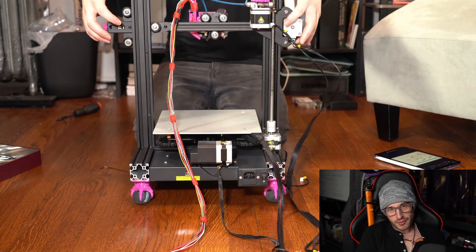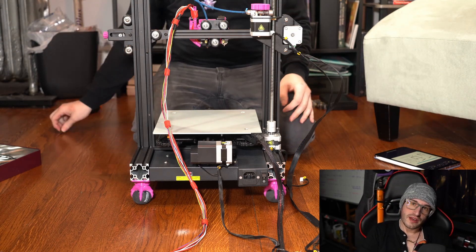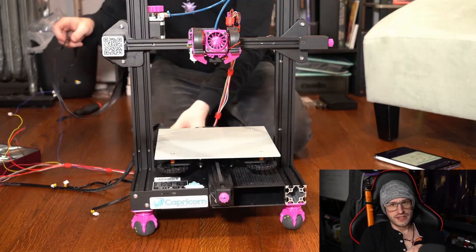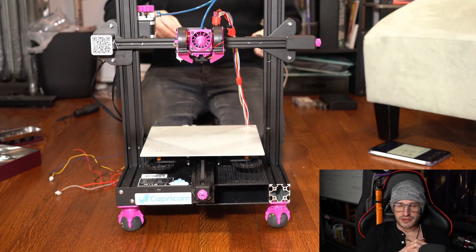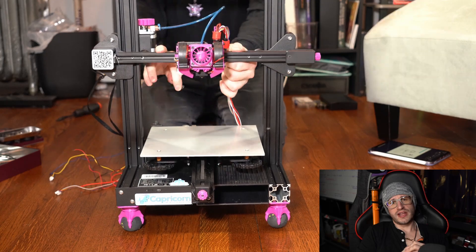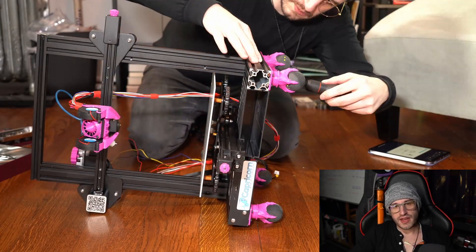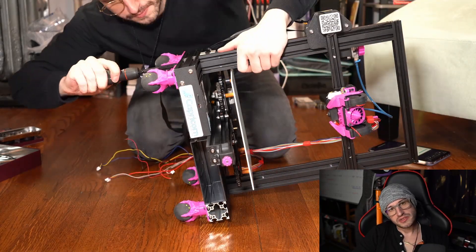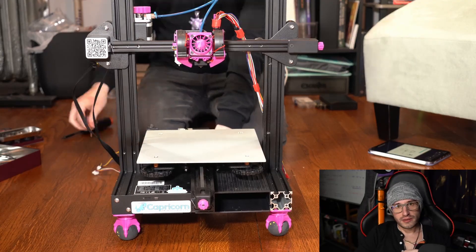The only thing I'm going to show in the video here is sliding the assembly over the z-axis rails and then making sure the lead screw threads into the hole near the extruder axis motor. I didn't have the camera angled high enough to see what I was doing in the next step, but all I did was attach the top rail to the two z-axis rails. It's important that all of the axes are perpendicular with each other, so I went back and tightened all the bolts to make sure everything is nice and tight and aligned properly.